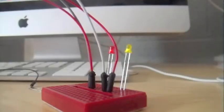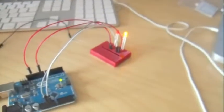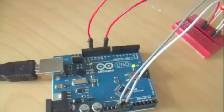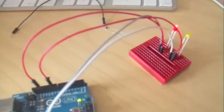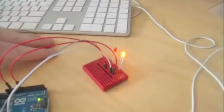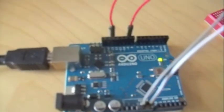Now we see a slight blink from the 13 LED signifying the read of the sketch, and then the lights should be flashing opposite each other. And that's where this tutorial ends. Again, you can use what you've learned in the past 2 tutorials to make different blinking patterns, and even add some more LED pins for more options now that you know how to wire the breadboard. In the next tutorial, we'll look at the RGB LED sensor, which allows you to make different colors with one light.